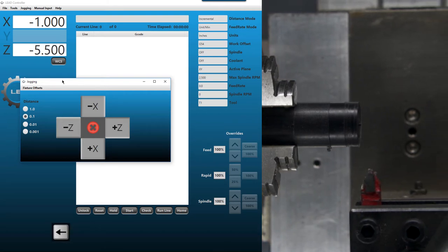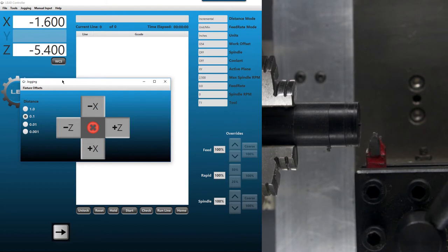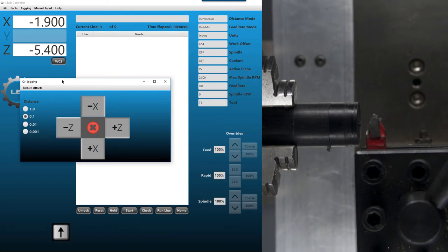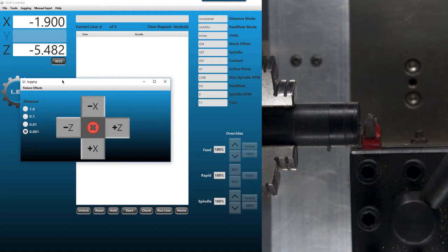I'm going to bring the tool in and touch the flat side of the tool to the face of this part — we've already faced off the part or brought in material that's been faced off. We want to touch off on that face, then do an offset of half the distance. Since this is a 60-degree tool and the tip is directly in the middle of the tool width, we'll offset half the tool width. As you get closer, don't ram the tool into the work — get in close, decrement your size to one thousandths, and slowly bump it until it just kisses the surface.